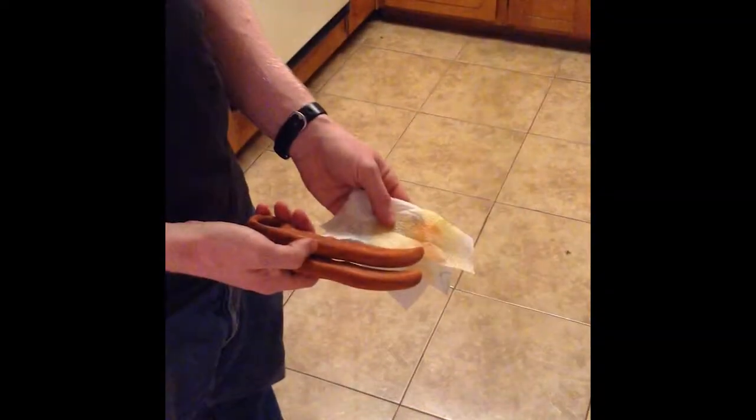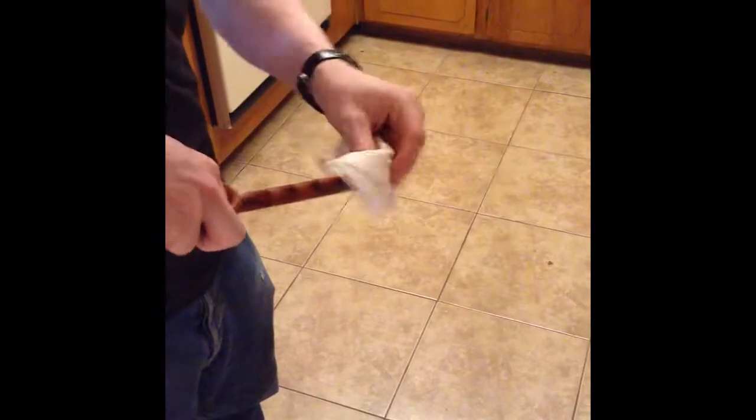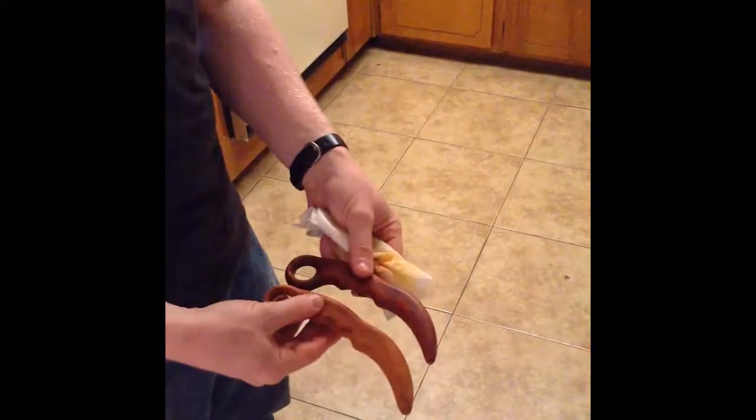Most of it does. So the last step after sanding it is to put on your finish. I'm using a boiled linseed oil. It looks nice, and with the sanding you can feel the wood when you're holding it, and it looks really nice. The greatest part about it is that it darkens the wood and gives it a deeper, richer color. The bright orange becomes kind of a deep sort of blood orange, maybe a reddish color, which you'll see in a second. And it's the quickest step.